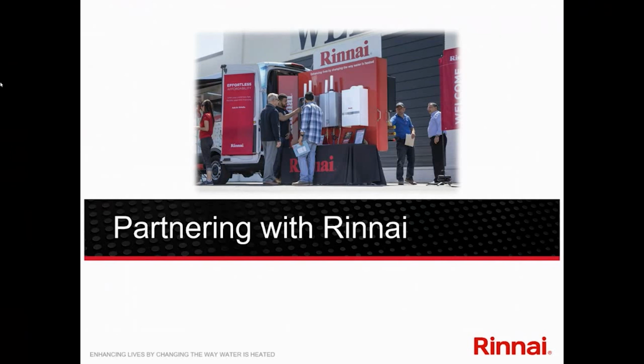You said we could derate, right? Is that in the general settings or where is that? Derate the heat side? You mean temperature? Just the temperature? You don't have to derate the boiler? Like if we say we want all the DHW we can possibly have, but we only need 70,000 on the heat side, and we need to do it at 120. Right, you're okay with that? We're not having overfire? No, it'll compensate for that. Okay.